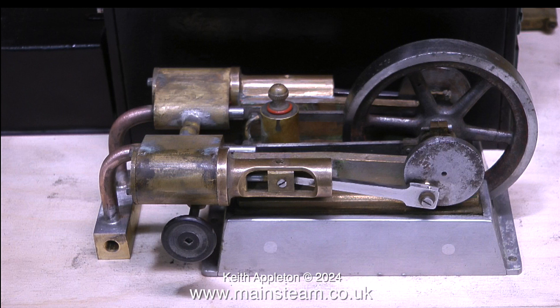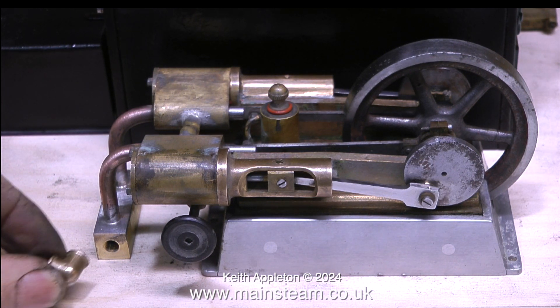After finishing the drilling and cleaning up the piece of brass on my belt sander, I soft soldered the collector to the end of the original exhaust pipes. Soft solder is sufficient for exhaust collectors, but you must never use soft solder for any high pressure live steam lines because the temperature of the steam will melt the solder. For larger high pressure models you must use silver solder on the live steam inputs.